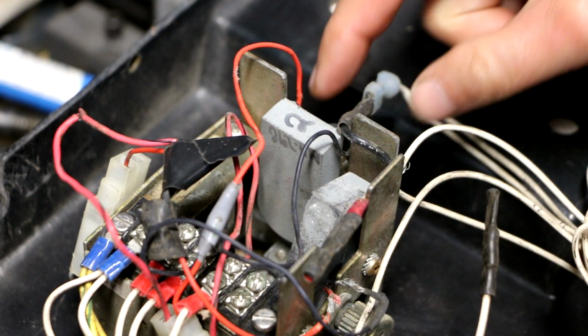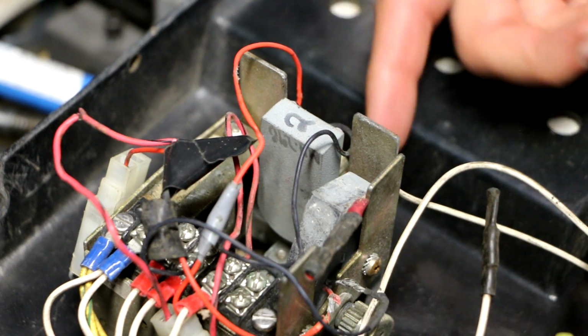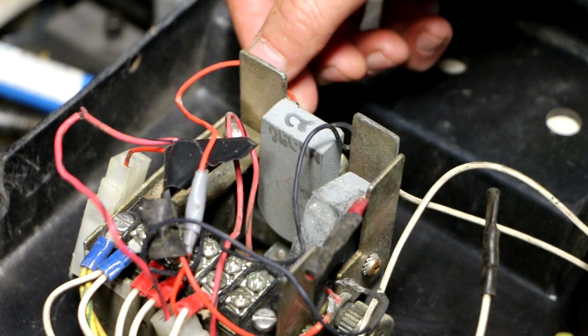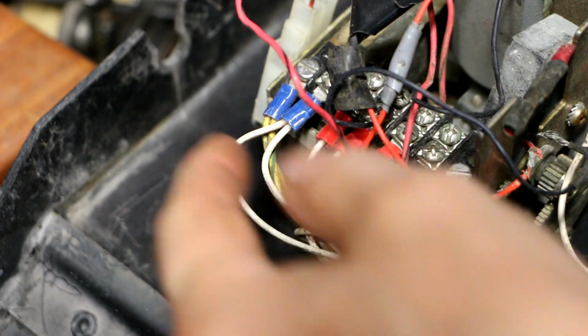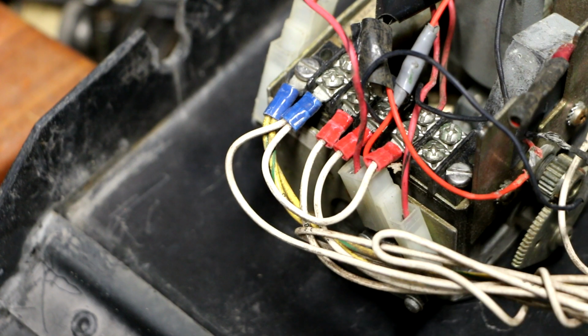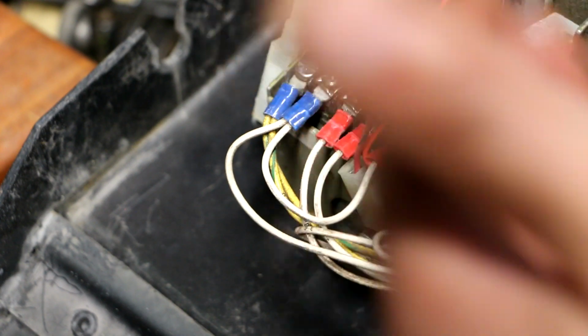This gray block back here is for the swing. So these 2 wires are going to that, and one of these wires looks damaged also. And if we look at this terminal strip, it appears that just like the other joystick, you really only have 2 connections to do both the initiation and the proportional part of the equation here. There's 4 wires because this is 2 of those in one assembly.